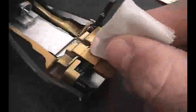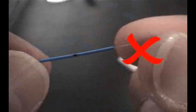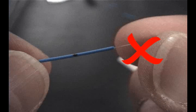The guide slot on the activation tool should be kept as clean as possible to prevent debris from transferring onto the fiber end face. Do not wipe any coating remains from the fiber with your fingers after stripping, as oils from your fingers can transfer to the rubber pads of the cleaver, reducing the effectiveness of the clamp arm and resulting in a poor cleave.